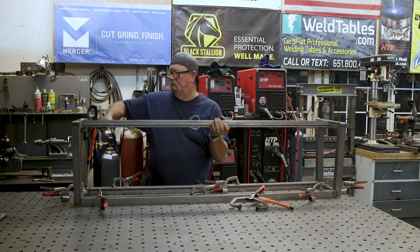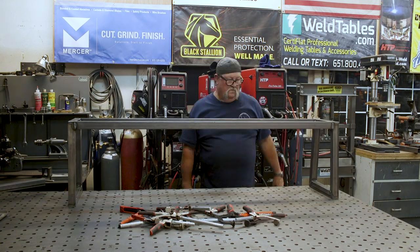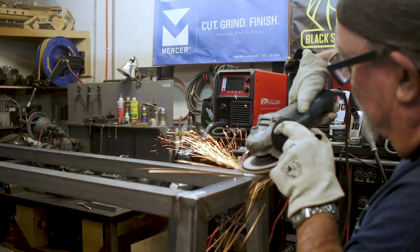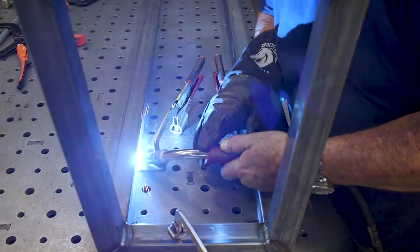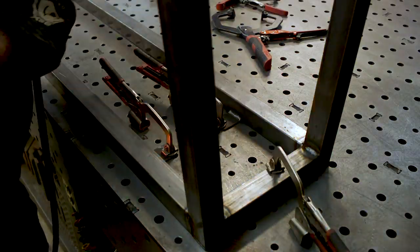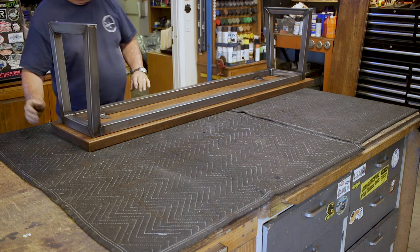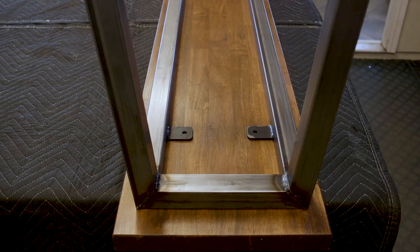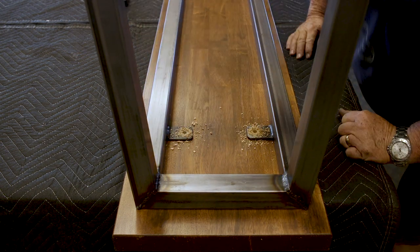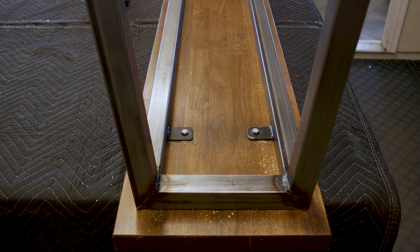I ended up finishing it here and then a couple more hours the following morning. My wife took everything out to them since I wasn't able to go — that worked out pretty good. I'm just finishing up the grinding on the very top where the bench tops will sit. Then some final tabs — this is how I'm anchoring the bench tops to the frames. The bench top just fits on there nice and square with a little cantilever all the way around. I pre-drilled and used 5/16 by one-inch lag bolts to attach them — these things aren't going anywhere.